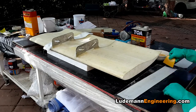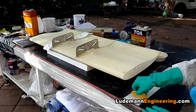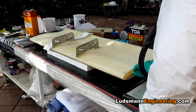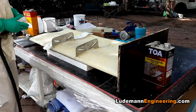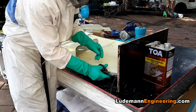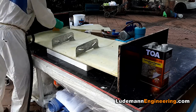I did about seven layers, wetting them out with epoxy as we go, to form a panel about a sixteenth of an inch thick, or 1.6 millimeters. Then we wet the surface of the end of the wing with epoxy and put the panel right on there, propped up with a can. We take some two-inch wide fiberglass cloth tape and lay that into the corner on both sides, wet it out with epoxy, and let it cure.